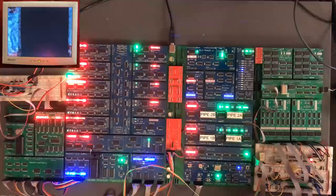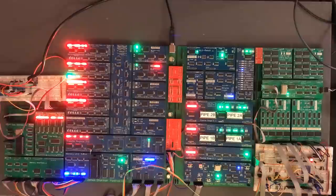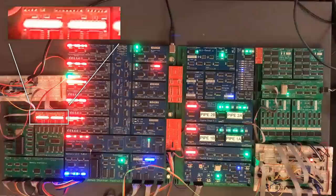Okay, well, that's obviously not quite working. The main frame buffer component does look right, but the scroll registers don't seem to be doing the right thing. Let's try writing to these directly. Okay, this should be the bottom 8 bits of X. Top. Bottom 8 bits of Y. Okay, they seem to work okay. Let's just try a different pattern.